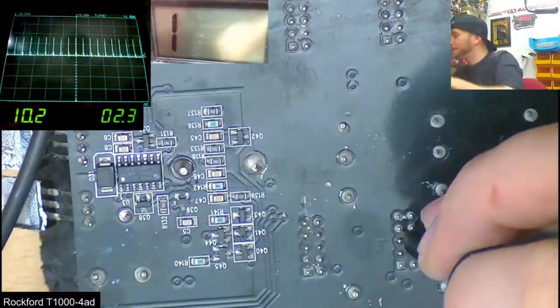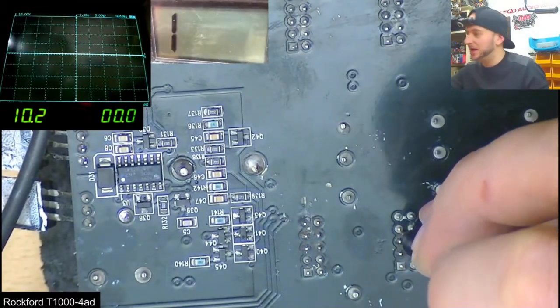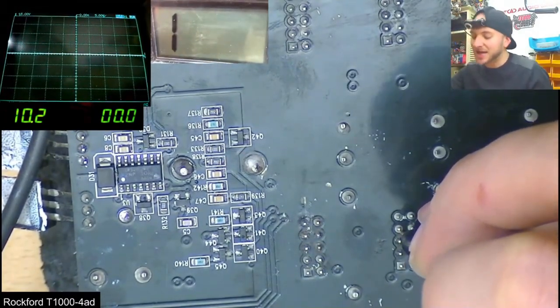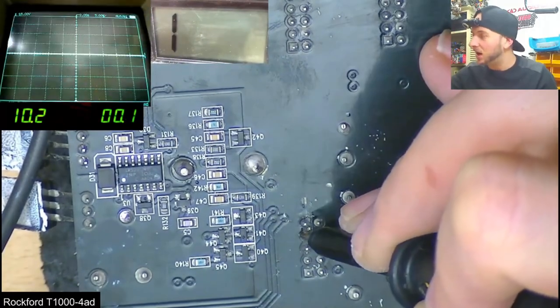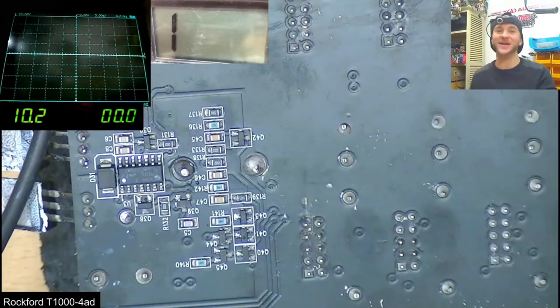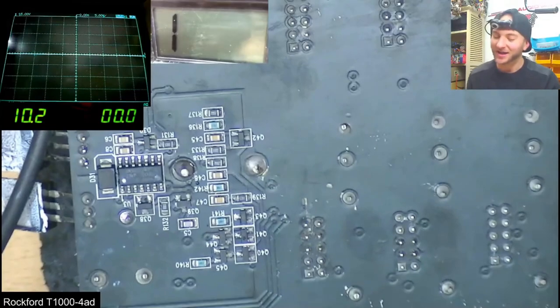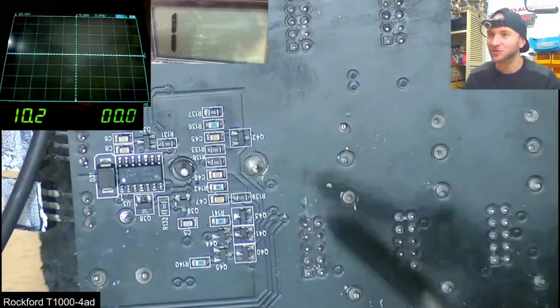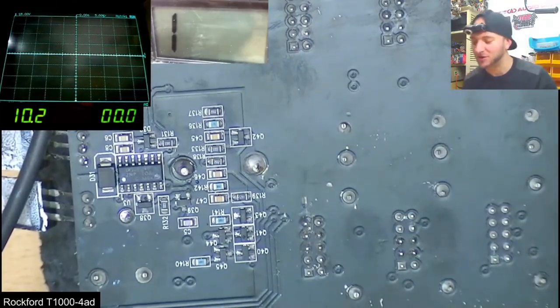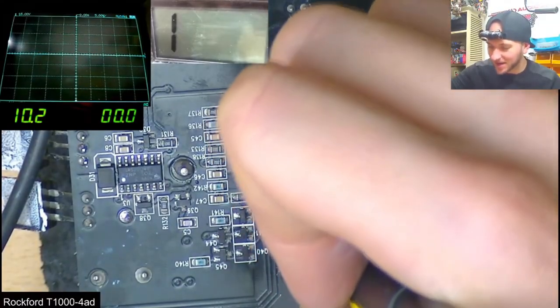What's interesting though is that the pulses for the bad channel were actually coming out of the daughter board for that channel. We have signal — that's a relief, because I did not like the idea of having to remove the whole driver card. But the pulses weren't making their way all the way to the drive chip. Something was stopping them along the way.